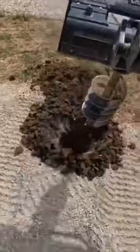That's just what works for me. The holes are minimum — frost here is 42 inches — I do mine four and a half feet, so around 54 inches deep. If you bring fill in, you want to get below that, so if you have to go seven feet to get to undisturbed soil, that's what I would do.